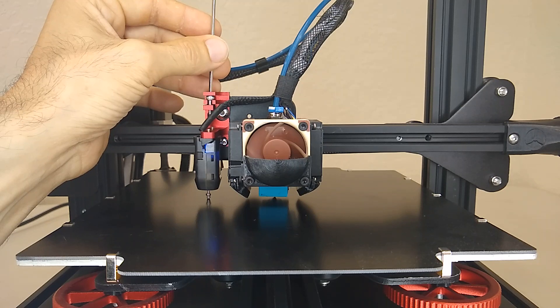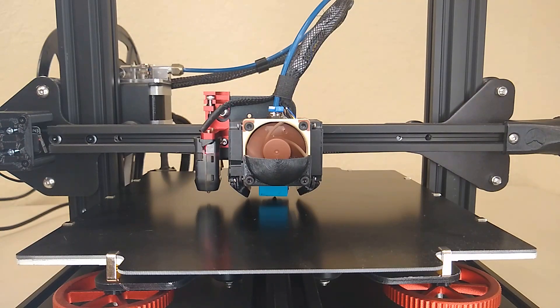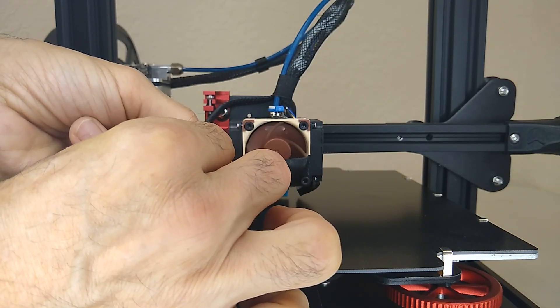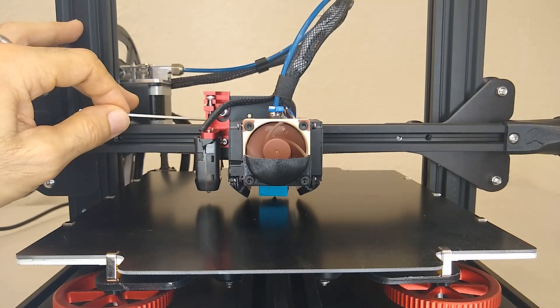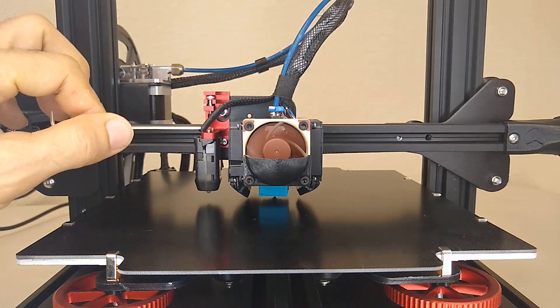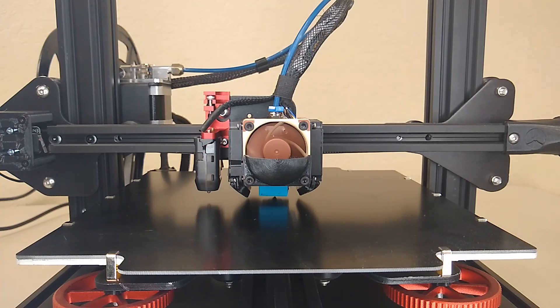You'll see the little light go red and it'll trigger — that's where you want to lock it down. Once it's at that point, go ahead and lock down your set screw. On the Ender 3 and Ender 3 Pro, you're only going to have one screw. The bracket has two positions for lock screws, so if you have a way to drill and tap for a second hole that would be great, but it works fine with just one set screw. On the Ender 3 V2, the bracket is drilled for two holes so you can simply reuse the existing mounting points.